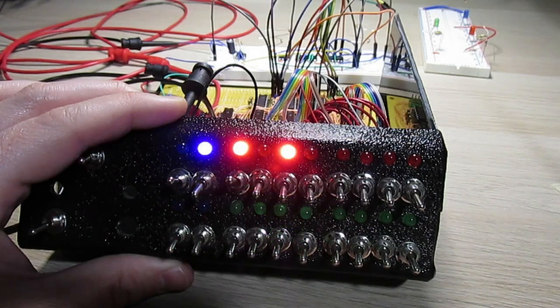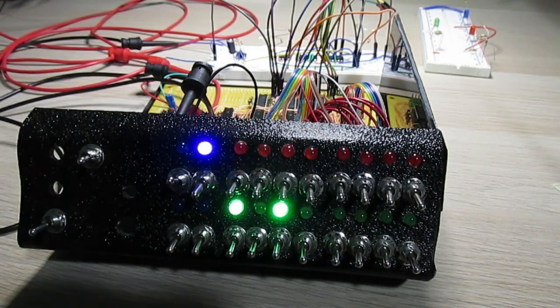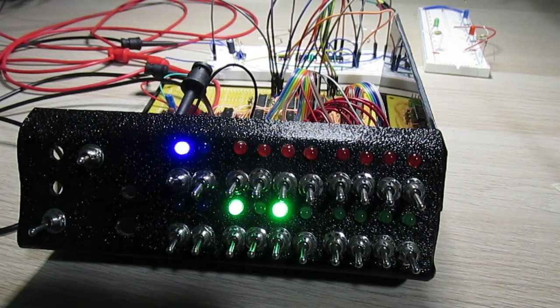I'm kind of proud of myself for this circuit. Clock multiplexing isn't the hardest problem in the world, but it's not exactly trivial either. And I haven't seen this solution anywhere else yet, so this might be a novel design. It's only really useful for switching between a free running clock and a manual or frozen clock, and in that case it's probably fine to just use an ordinary multiplexer anyway — but I still think it's kind of cool. Now I have everything I need to have all sorts of fun with digital circuits, so let's go hard and build a CPU in the next video. I'll see you then.